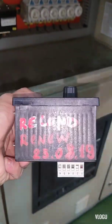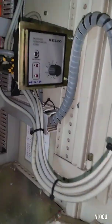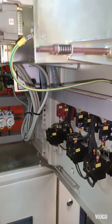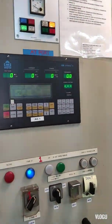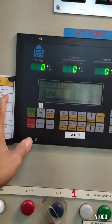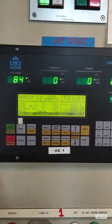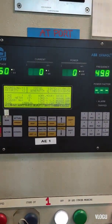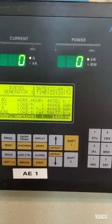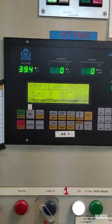After a week, I already replaced the reconditioned or damaged motorized potentiometer and installed a new one — a new Selco motorized potentiometer. Now I start the generator to test if this potentiometer is good. Our RPM is 1489.0 and the frequency is 49.6 Hz — a little bit low.